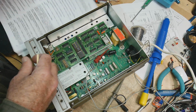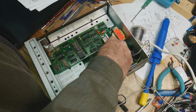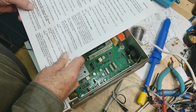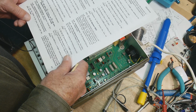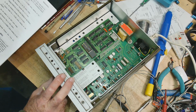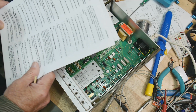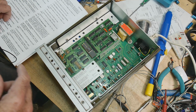Okay, 0 volts. All right, disconnect the meter from the instrument. Okay, now we're going to adjust 19k ohms. The following procedure calibrates. Do the following. Set the meter to ohms function. Okay, ohms. And the 20k ohms range, okay. Set the divider box to 19k ohms.